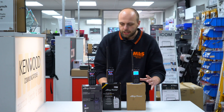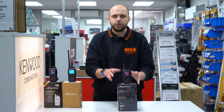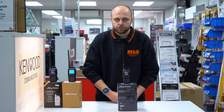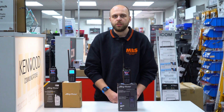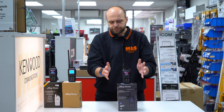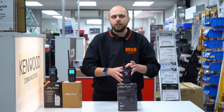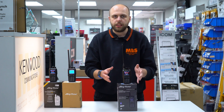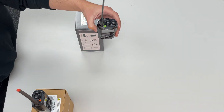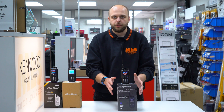Moving over to the new ATD878UV2 Plus — things get quite confusing, don't they? This has all the features of the previous ATD878 but adds an increased capacity for up to 500,000 contacts, still retains 10,000 talk groups, and also has an enormous 500 hours of recording time. But the main features are of course Bluetooth and now APRS on receive — so you can do analog APRS AX25 packets on receive as well as transmit. And if you want to call this a feature, the button on the top has gone from blue on the previous version to green on the new version.